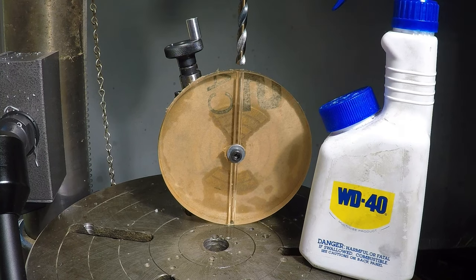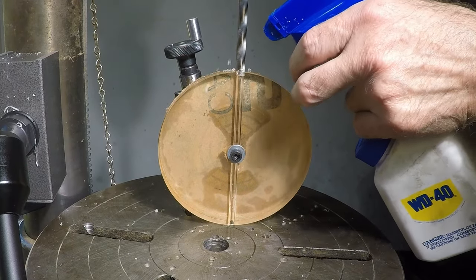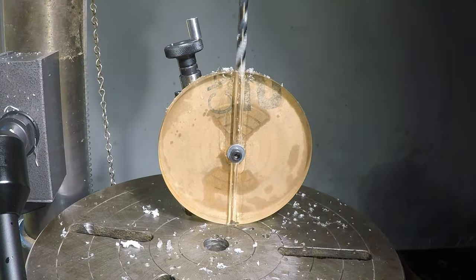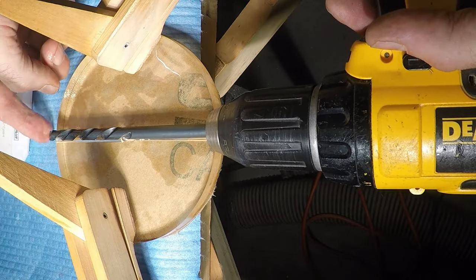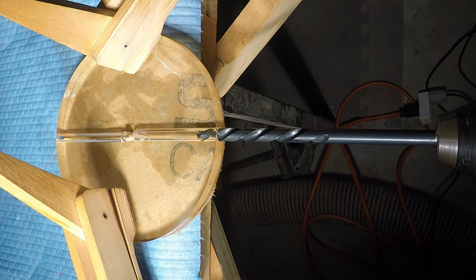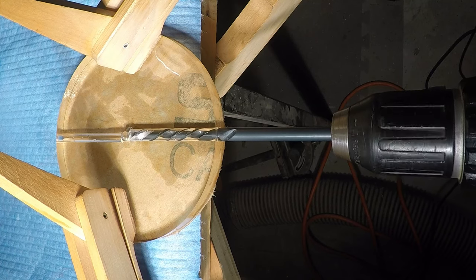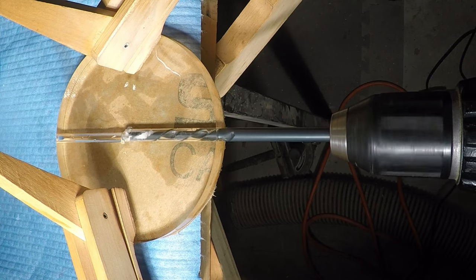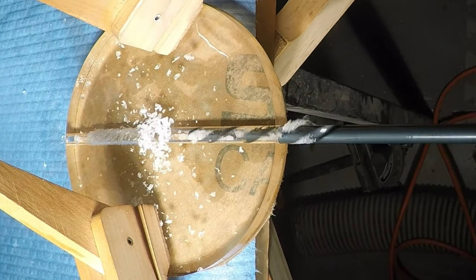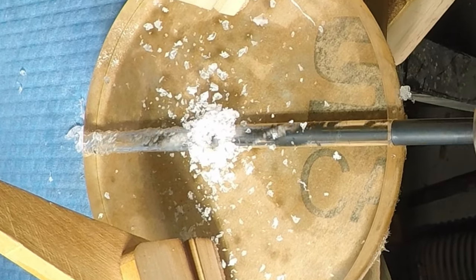So what is Plan B? If I drill it out to a 3/8-inch drill, I have a longer drill bit that would go all the way through. I'm going in with the short drill first, and then if I take it off and use my cordless drill with the 3/8-inch bit, I think I can just blow all the way through and make a through hole that is perfectly true. But it grabbed and chewed up, making a mess of the hole. But what the heck, I'm going to keep going — maybe this is a valuable lesson.